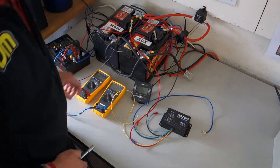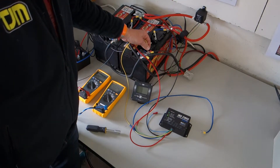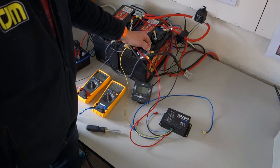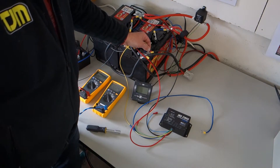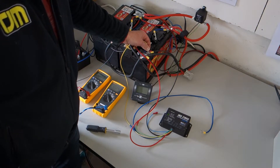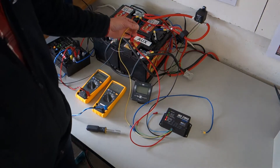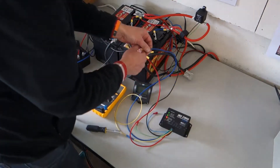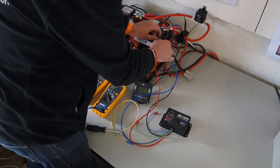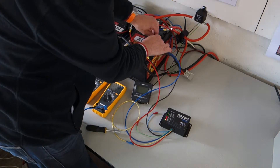The DBM has now started. Go through the program cycle by touching the yellow wire to minus. There are six different program steps, all in a cycle — if you go one step too far, just keep going until you find the correct program step for your batteries. We select high level with equalize mode. It starts flashing and the system is now active. The last step is to attach the blue wire to the second fuse box, and the basic installation is complete.